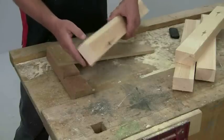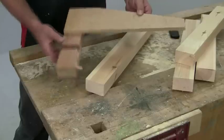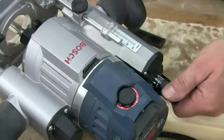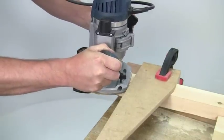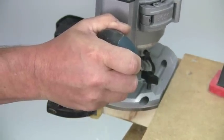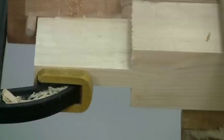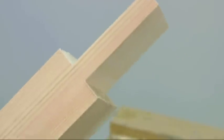To cut the tenons, I use a simple jig, just like a heavy duty T-square. This is just two pieces of scrap screwed together at a perfect right angle, with a dowel as a stop in the end of the stock section. The router bit is adjusted for depth to leave the required tenon thickness. The after-lock adjustment on the Bosch router makes this dead easy. With the jig firmly clamped in place, you can route away all the material to form the tenon, taking care that the router doesn't tip as the supporting waste is removed. Then finish off by running the base up tight against the jig to form a perfect shoulder. Simply turn the work over and repeat the procedure. The dowel stop ensures the shoulders will match perfectly on either side. This router jig is by far the easiest way I've found for producing accurate tenons on big work pieces, and it's so quick and simple to set up.